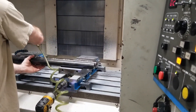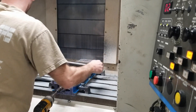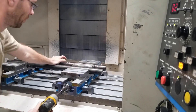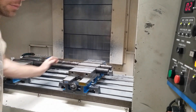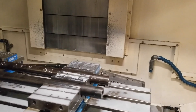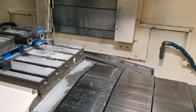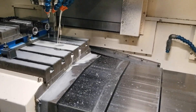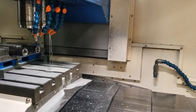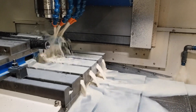This control arm-to-be still needs a machined slot for the clamping feature and a cope for welding to the flex end tube. This is done in one of our CNC vertical machining centers. The machinist loads the mill with two parts at a time, tucking them tight against the hard stop on the left while clamping them down for the milling process. The mill makes its cuts on the newly threaded side and finishes with a chamfer to remove any sharp edges. After the relief slot and cope are cut, the control arm is ready to be welded.